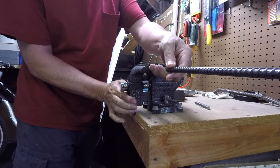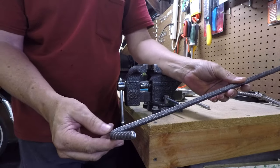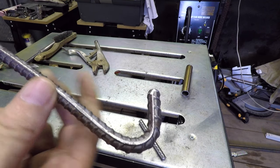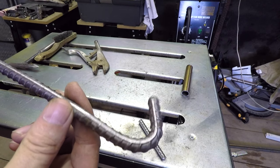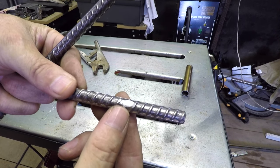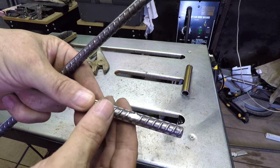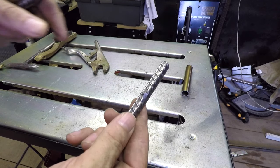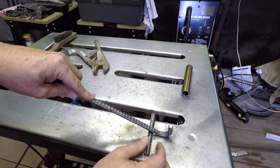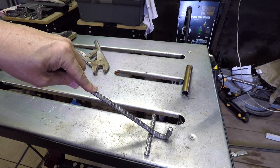Just a little more tweaking on that to tighten things up. It took about three quarters of an inch off the hook, smoothed it out just like before. Got the hook shaped the way I want it. This cross piece — one of the ribs in the rebar was right at the center where I want it welded on. So I just took my flap disc and ground a little flat spot, then I'm going to rig this up so it stays right where I want it so I can weld it with the Harbor Freight 90 amp flux core welder.